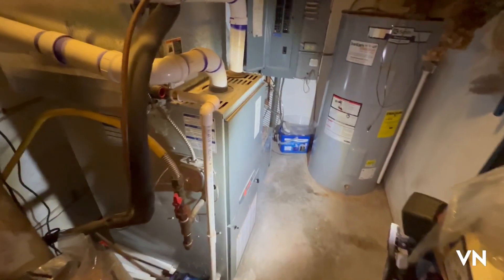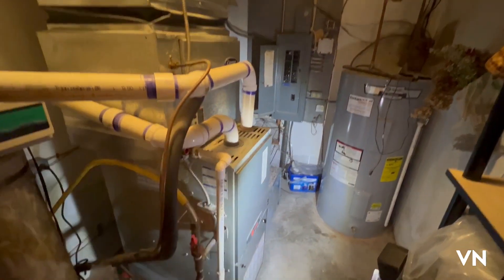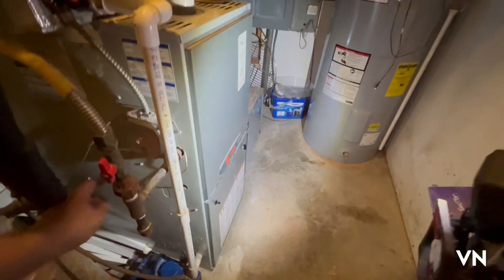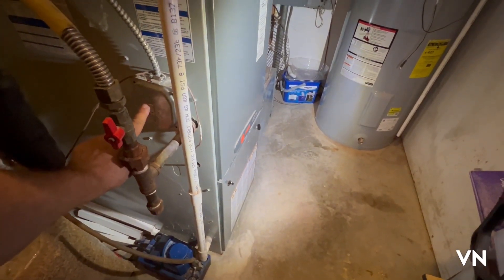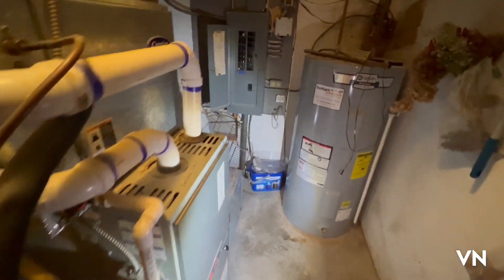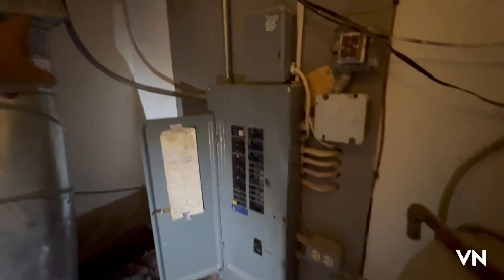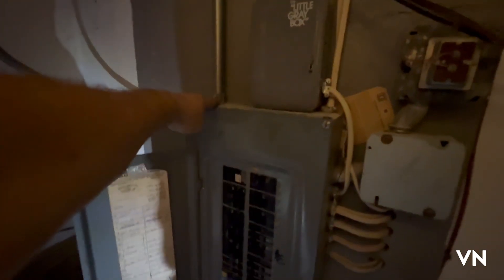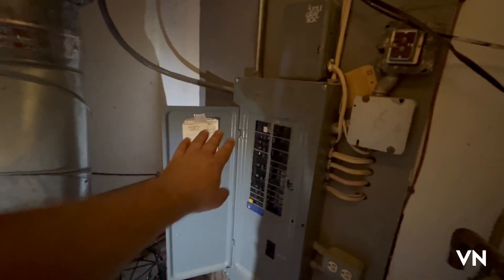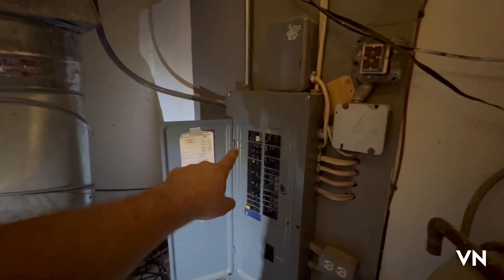Here in the mechanical room — kind of tight spaces, so I got it on wide angle. The fuse panel is right there, and the air handler is right here. This is your maintenance switch — it's a 110 maintenance switch. I opened up the panel and followed this wire here, which is a 110 that comes from or goes to the air handler. I made sure I had 115 volts coming off the panel — the breaker was good.